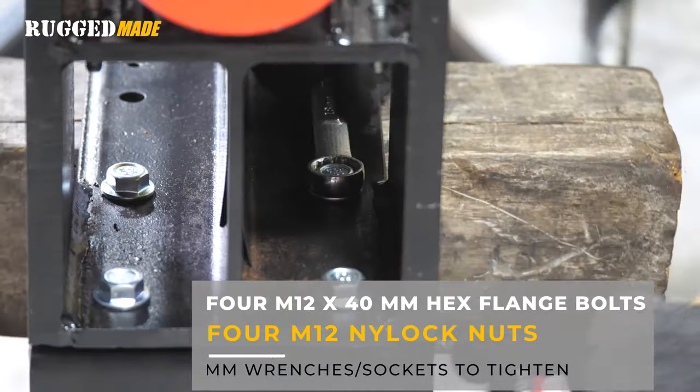We're not going to install the pump on the Honda today — just pointing out one difference, which is the bolt spec for mounting the pump mount bracket to the engine. The threads are different on the Hondas: it's an SAE standard fine thread bolt. If you order this engine, you'll get the right bolts for it. If you have one of the Raven engines, it would be a metric bolt. Both the 13 gallon per minute and the 16 gallon per minute pumps have a four-bolt flange and both would mount on either bracket, but you'll get the right bracket for the engine you selected.